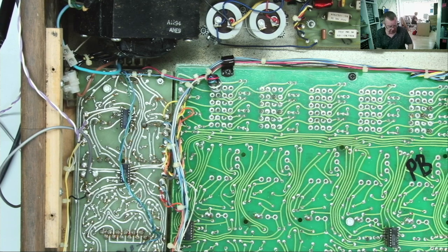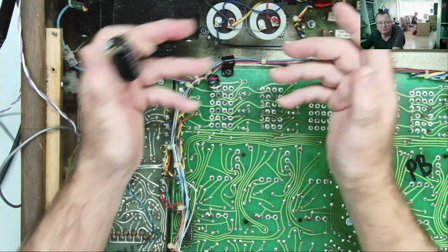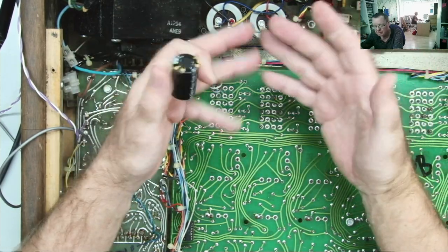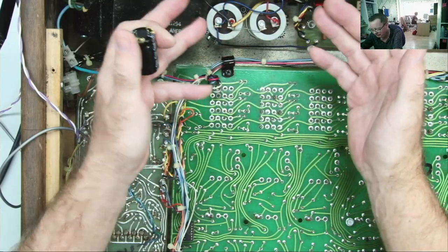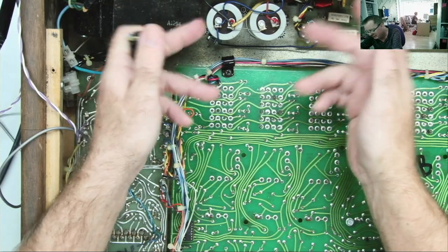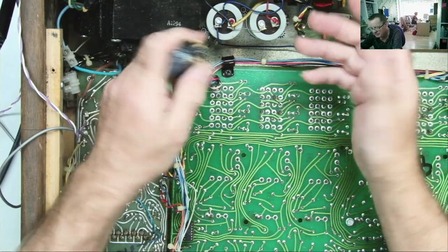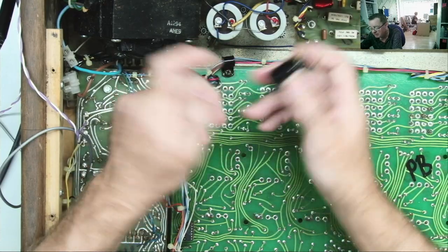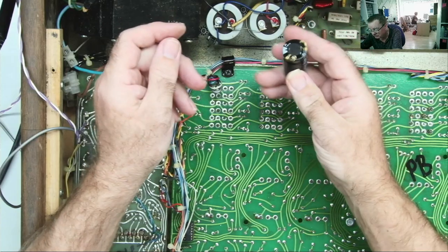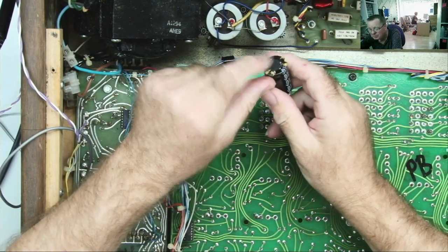You'll notice I'm not testing the ESR of these capacitors. That's because when it comes to bulk capacitors, large smoothing capacitors like this, on mains frequency circuits, 50 hertz or rather 100 hertz after the bridge rectifier, ESR isn't really an issue. That becomes an issue at high frequencies and in switching power supplies. So for these sort of capacitors, ESR really isn't important. Comments?